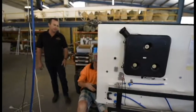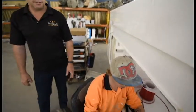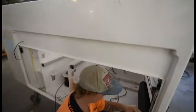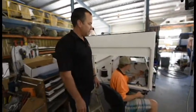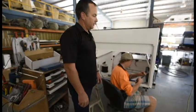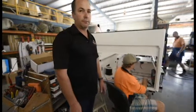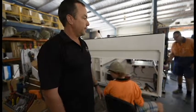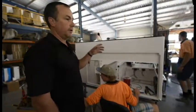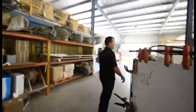Just around here, Jess is doing all the wiring. He's fitted the battery tray and he's fitting the Redarc system into it now. We use the Redarc BMS 1230 Life Pro Series, and that does lithium batteries as well if the customer decides to opt up for lithium batteries. Once Jess has done all his wiring — that's the complete wiring right round to the kitchen, round the back — all the switch panel gets fitted.